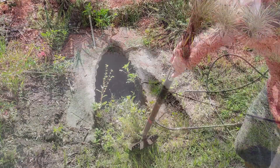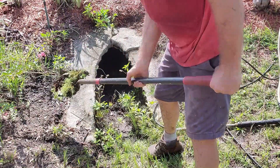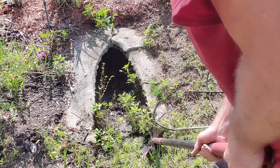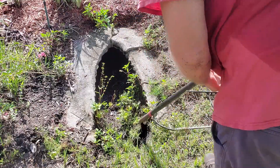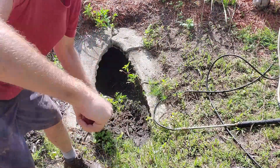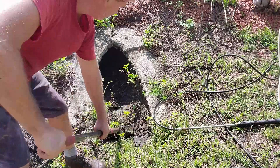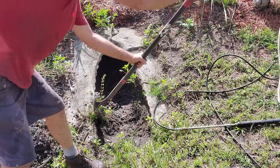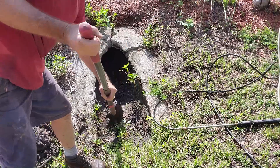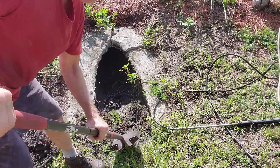Just like we did on the other side, you've got to start by cleaning out the opening of the culvert. This can be done with the shovel — doesn't take much, just need to get as much out of there as possible before you put the jetter in. This is a really great project for the do-it-yourselfer and can truly save yourself five, six, seven, eight hundred dollars depending on who comes out to clean that culvert.